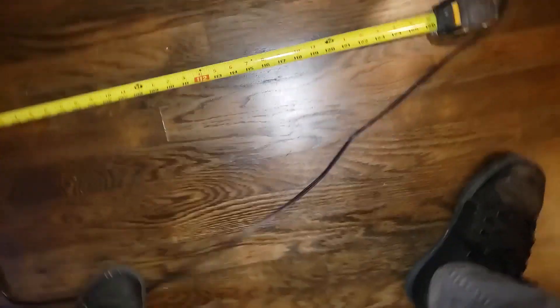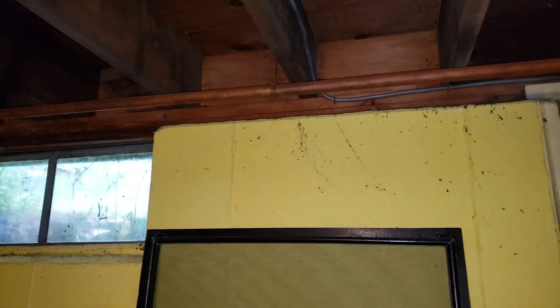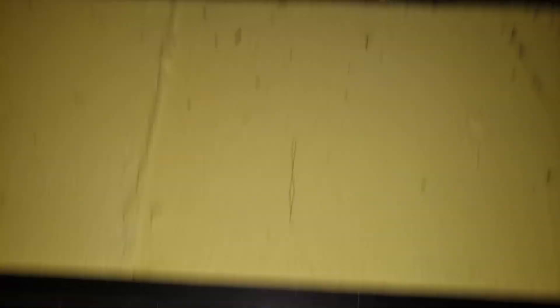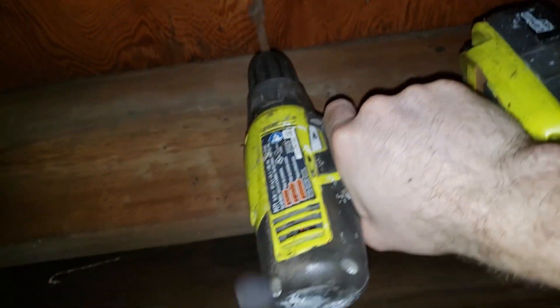It's good to have a visual reference in the basement. There's a copper pipe leading to this radiator — I'll measure from that pipe to the wall and we're at around 10 feet. Down in the basement, I measure 10 feet from that pipe, and about 19 inches from the concrete wall. With a cordless drill and a 3/4 inch wood boring bit, here's our mark and about one inch away is where I'm hoping to drill through.